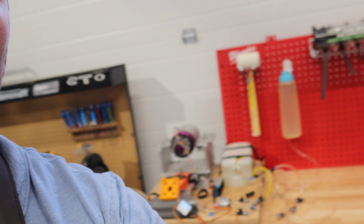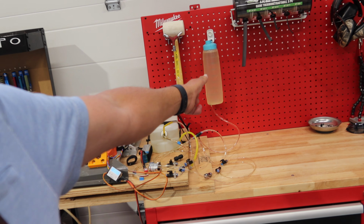So that also means we will be testing the restart function on this engine. Once we get it running, we will check the acceleration rate on the engine. And then we are going to try the restart. We'll try the restart function. And then we'll do the full throttle test for the fuel consumption to see how long it takes to go through 1 liter of fuel, which is our little tank right there, measured perfectly at 1 liter or 1,000 milliliters.